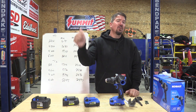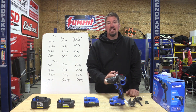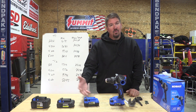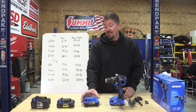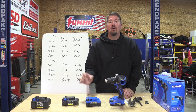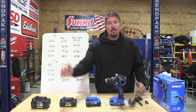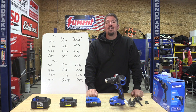Very cool test. Love to hear your comments below. We've done this with Milwaukee and DeWalt and seen the differences as we climb up in battery size. We're looking at power output of the battery using the amp hour names as reference. Amp hours doesn't mean a whole lot other than run time, but as you can see, between the 4 amp hour extended run and the 4 amp hour ultimate there is a difference in power output, and obviously a difference in cells inside. Please give us a like on this video, subscribe to the channel if you haven't already. Thank you for your time, have a great day.